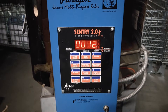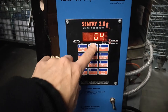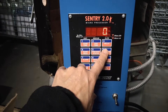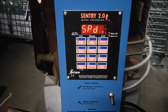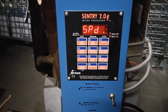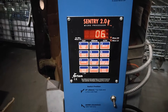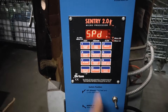Set the Cone Fire by pressing the Cone Fire button here — that will tell you that it's set at 04. If you want to change it to an 06, you just press the 06 button and enter. However, I'm going to go back and make sure that is set for an 04 fire. 04 and enter.